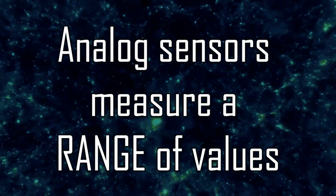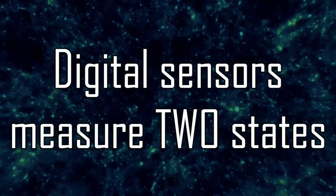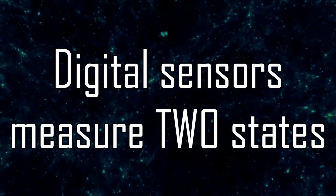Sensors can be either analog or digital. Analog sensors measure a range of values, so things that measure light, temperature, or sound, for example. Digital sensors measure only two states, like on and off or present and absent. Some examples are push buttons, reed switches, or tilt sensors.